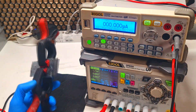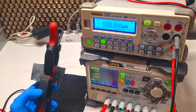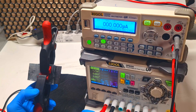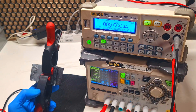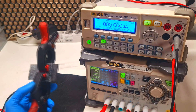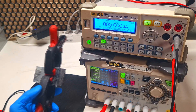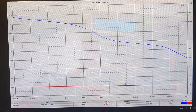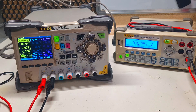I also want to know if I got the right capacity for this type of battery. The charging time with this power supply was a little shorter than with my old supply. The expected charging capacity for this type of battery is around 100 milliamp hours per gram, or 150 milliwatt hours per gram of active material. After a little more than two hours of discharging, I got a capacity of 114 milliamp hours and an energy of 155 milliwatt hours. That's it for now — see you in the next video, bye!